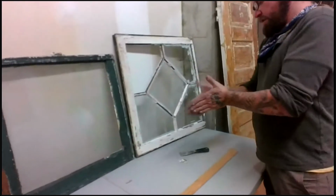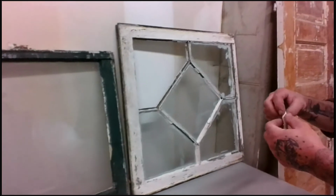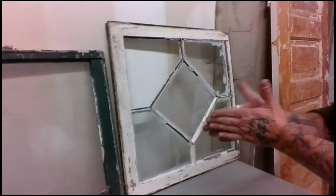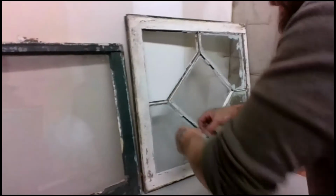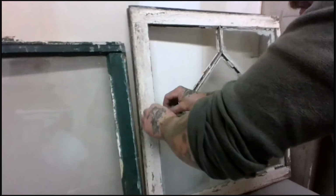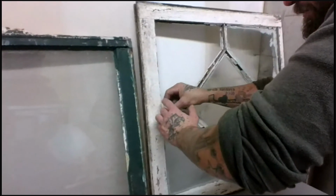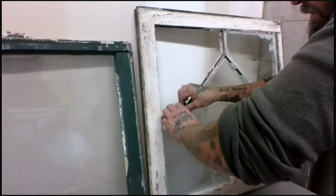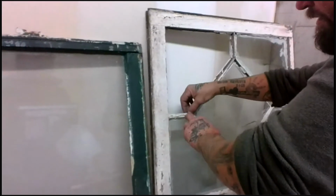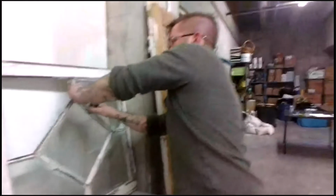And just work your glazing up until you want it to be about 1/2 inch to 3/4 inches high, and make sure it's all malleable. And then basically you're going to put it up against the glass and form it with your fingers. It's a little hard to do without the glass, but so we'll move over here.